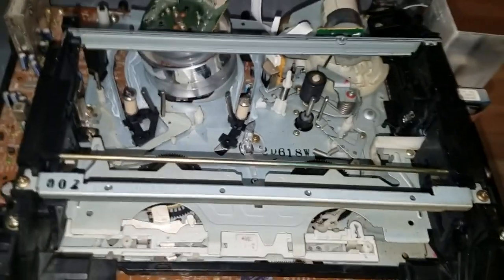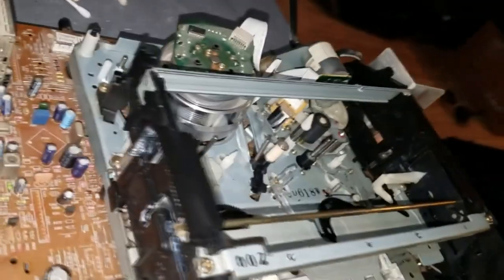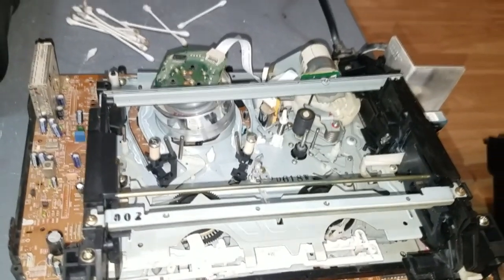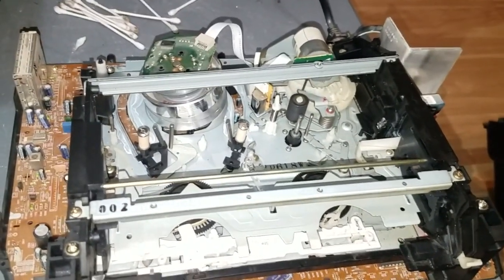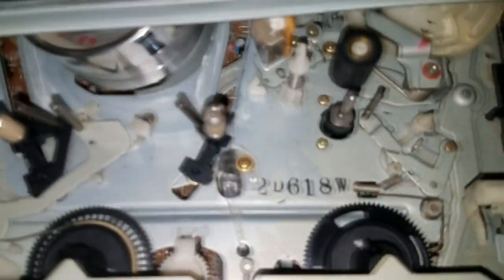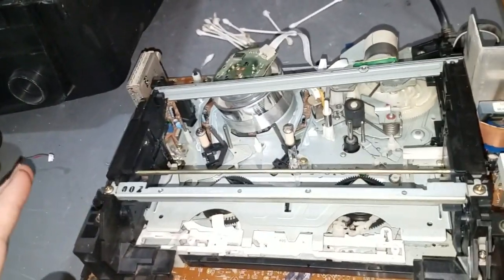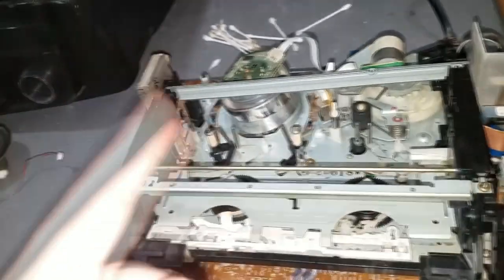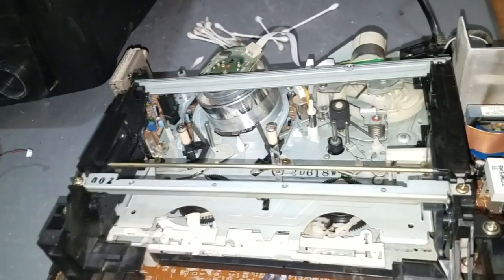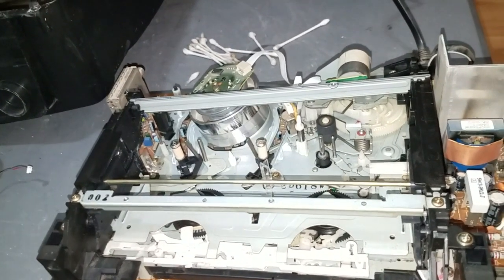So, with my non-existent tape inserted, I started rewinding, and I took the remote control and pointed it at that photodiode and hit a button, and it stopped rewinding. So it was like, phew, okay, both the photodiodes are working. This is great. So I thought, okay, what is causing the photodiodes not to see the infrared light being transmitted from here? Well, I know some of you are going to say it, so I did make sure. I turned out all the lights in this room so that it was dark, so ambient light wouldn't be messing anything up. And I put a real tape in and tried rewinding, and it still didn't work.